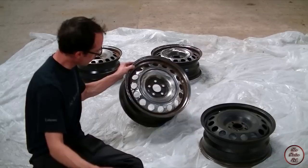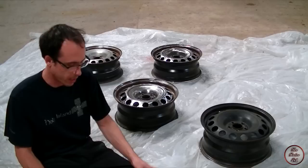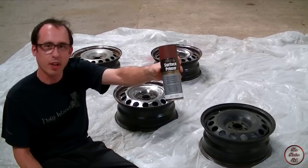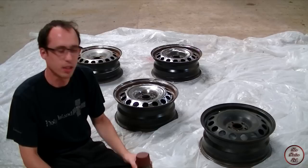We've left different amounts of rust on different wheels just to see whether you really need to clean them up well, or whether it's okay to just leave a bit of rust on them. I'm going to be using a brown primer and then spraying them green. I chose brown because white primers make colours brighter and black makes colours duller, so brown should be a nice even one - shouldn't be too bright. Let's get cracking.